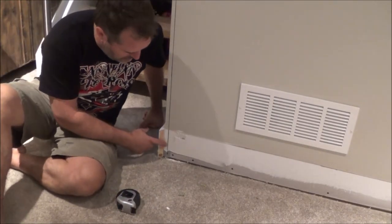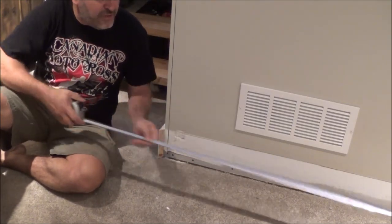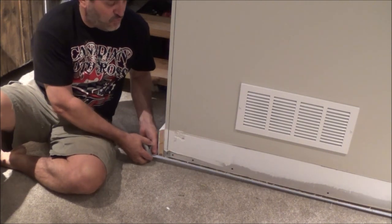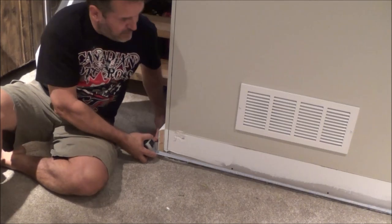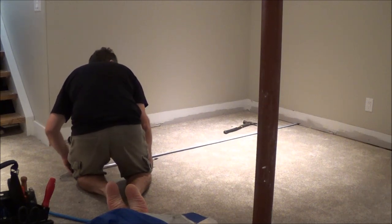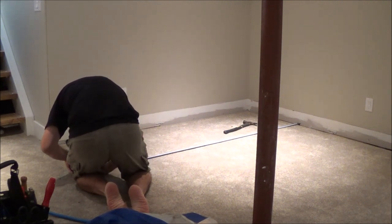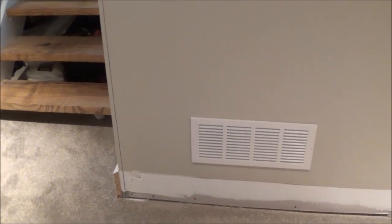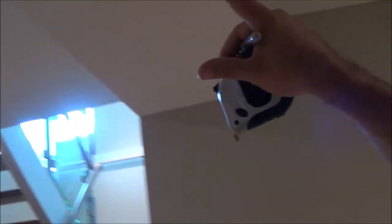With my first wall reference line, I take a measurement of this line off the wall - that measurement is where the end of this first wall will be. You could square off the other wall or come perpendicular, but this is the way I'm deciding to do it by measurement. I've marked the four corners off on the carpet, and now with two reference points for each wall, I can put the laser on it - just like a gun sight - to get the ceiling lines all the way across.